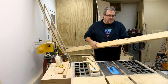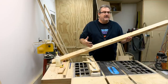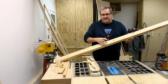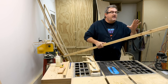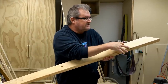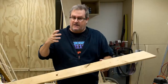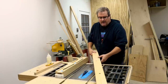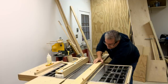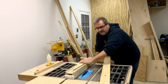I'm going to take this one and cut it. This two-by-four has been in my basement for months, so it's fairly dry — when you leave kiln-dried wood for months it naturally releases those stresses, although there might be some here. The things to watch out for when cutting a two-by-four like this are knots. You've got two knots here, and as you cut down the middle this may try to close together and pinch on the back of the blade and kick back. I'm going to rip this right down the middle. First I'll set the blade height to just slightly higher than the wood, set my fence to one and three quarters, and start the cut.